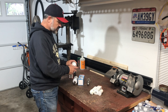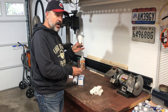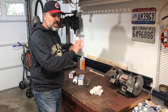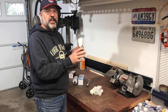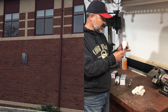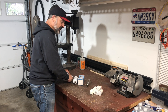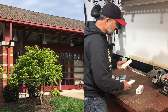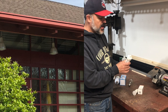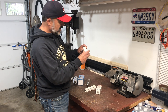There are three decorative fixtures on the back which I'm going to replace with an 11 watt A19 LED in replacement of a 100 watt metal halide. It's decorative and really doesn't produce much light on the ground — it's more of a decorative fixture on the side of the building, so an 11 watt LED A19 is going to be more than sufficient. And then I have one other area on the porch — these are called PL lamps or CFL plug-in lamps. Existing is a 26 watt and we're going down to a nine watt.